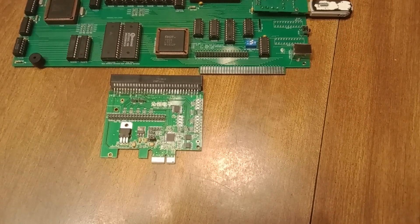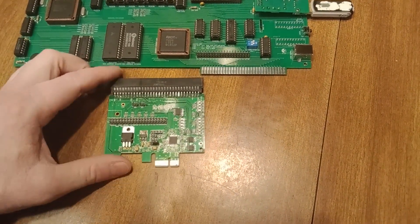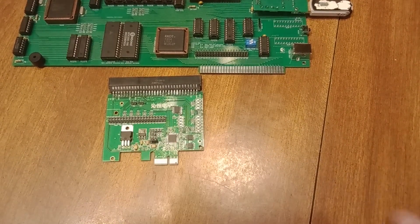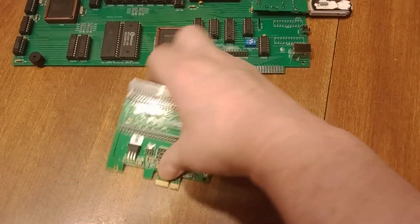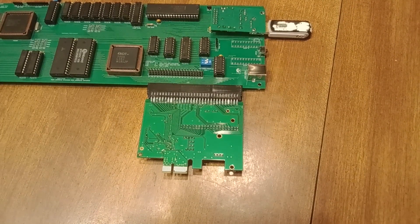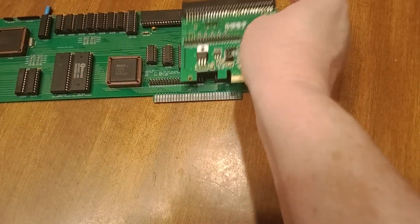Where I really want to go with this — PCI Express. This is a CH367 PCI Express, and it goes to an 8-bit address and an 8-bit data. This is not pin-matched — you'd have to use individual wires. You can plug it in right now and it will plug into PCI Express, so you would have an 8088 class PC running inside of your PC.